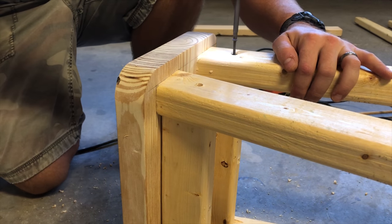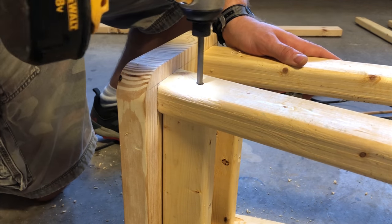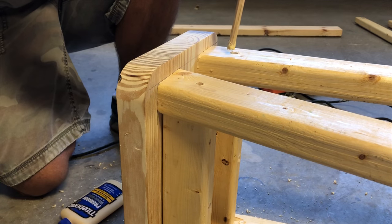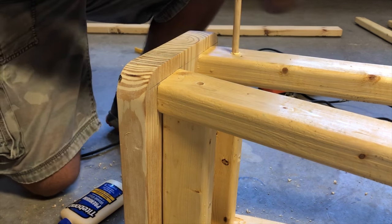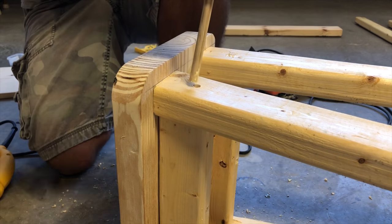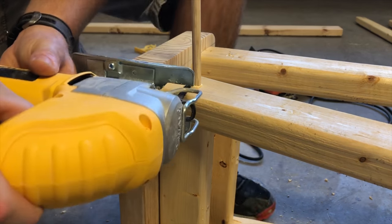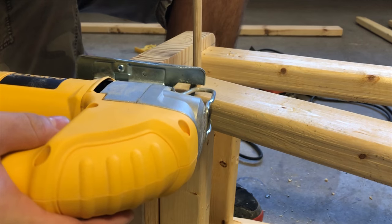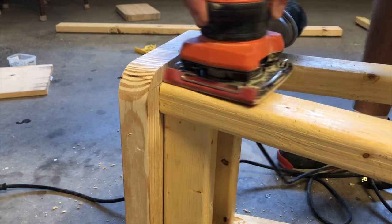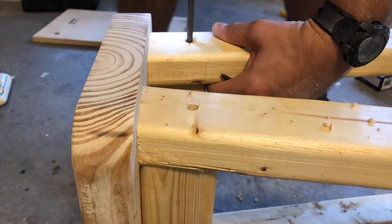If you're not a risk taker, you may want to pre-drill before screwing your legs down to your braces. I'm just using two and a half inch screws to give the legs a little bit of added strength. Take your three-eighths inch dowel rod and put a little wood glue on it. You'll jam this down as far as it'll go in the three-eighths inch holes, then trim it off as needed. We'll come back in a minute and sand these all down. This is just a nice neat way to hide your screw holes. You'll do the same thing to the other side.